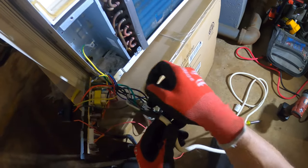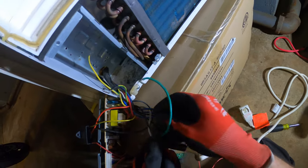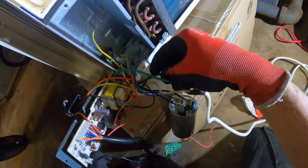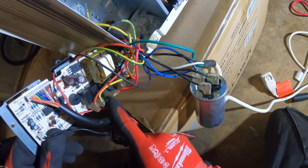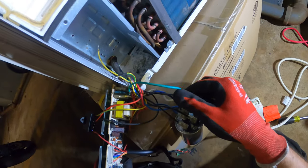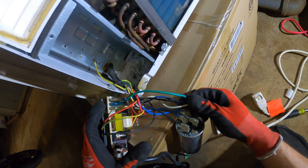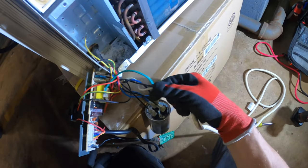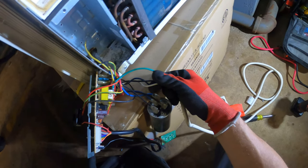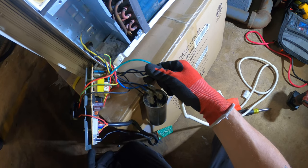this plug. So I try to follow our main cord. Just always start with power in. Green is our ground. It's 120 volts. So black is our hot wire. Comes into the board onto this little relay. And the neutral goes to the board. So what I'm gonna do is let's disconnect our power in. Let's see if I could make this happen.